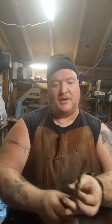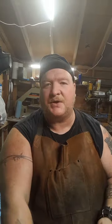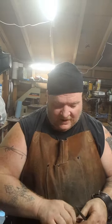So what we've done is forged out this nice little piece here, took a lot of that weight off. Now it kind of looks more like a flame, and of course we're going to repolish it so it looks like copper again. We're going to take it to the grinder, put some little fancy shapes to it. I kind of got the overall flame-ish shape I'm shooting for because it is supposed to be a fire wand - remember with the piece of red there. We're going to make sure the copper shines and polish it all the way up to the thousand grit, then glue it all up and be ready to go.